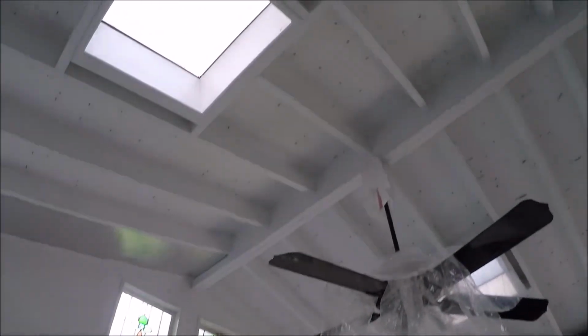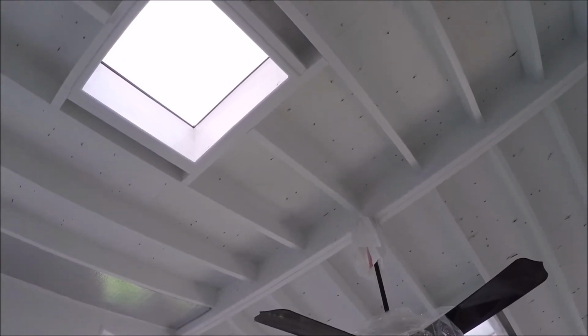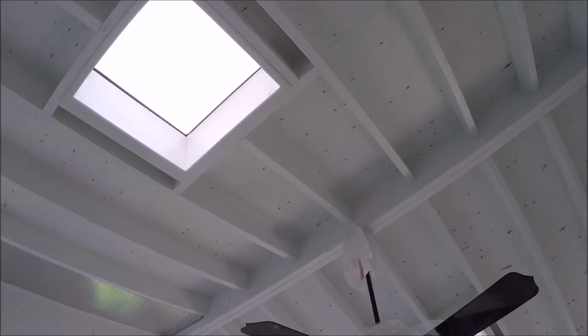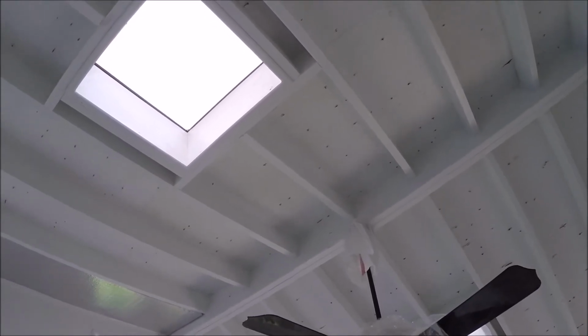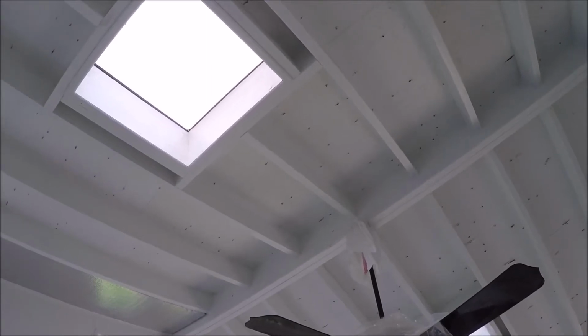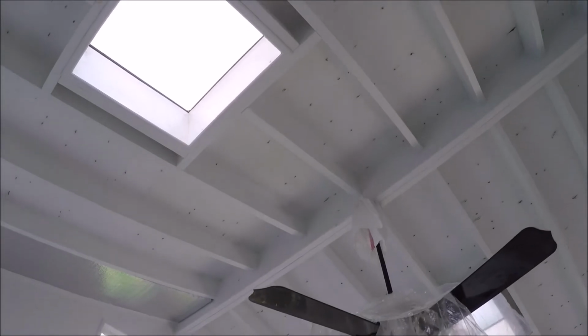But I didn't know how to insulate. I need to cut a ridge vent up here. That's a doubled up 2x10. And the roofer said he didn't want to put the ridge vent in there because you would have to cut bigger than 3 inches. Well, I'm getting ready to get up there today and cut about a half inch on each side of that, which will give me 4 inches.